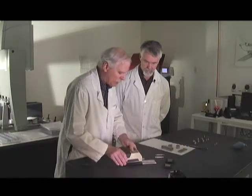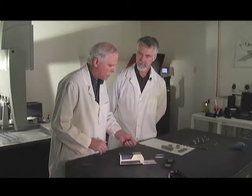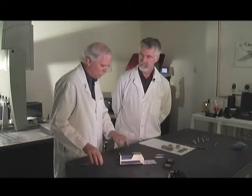A question we get asked a lot is: why do you calibrate up at 116 or 118 when you're measuring something down in the range of four or eight? The reason comes down to percentage of error. If you're a little off on 118 — due to dirt, contaminants, not being entirely perpendicular, or vibration during measurement — it's easy to be off by one or two millionths. One or two millionths at 118 is far less significant than calibrating down at four or eight, where a difference of one or two can be 50% of your reading.